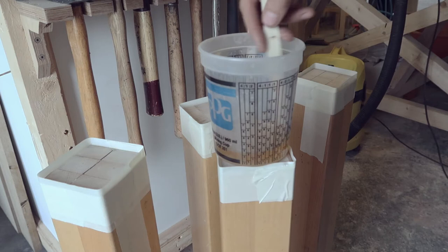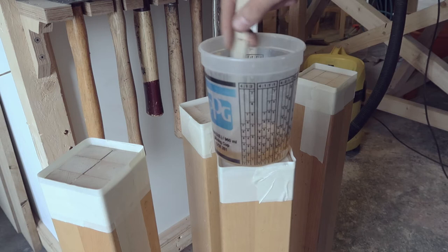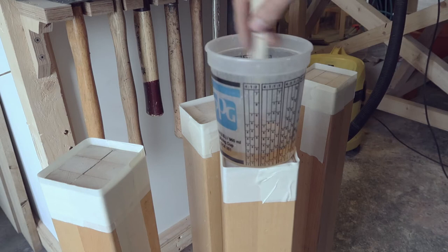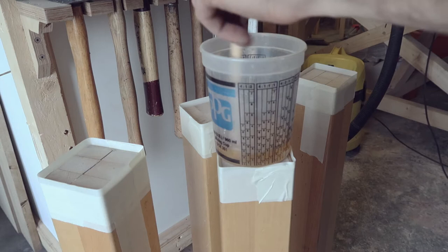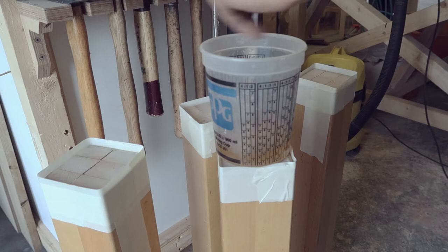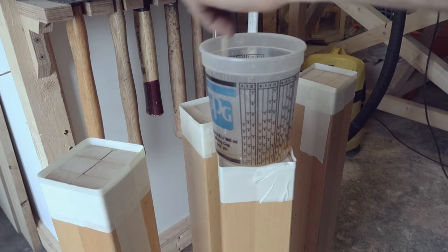Now here we don't really care, but if you're doing, for example, knots or something like that, if you're filling in a piece of wood, when you mix it like this, you put a bunch of bubbles into it. So actually, if you have a vacuum chamber, it would be good to put it in a vacuum chamber for a few minutes to get the bubbles out. And if not, the bubbles come to the surface eventually anyways, but then they kind of stay on the surface and ruin the surface of the epoxy. So what you can do is take a torch and just go over it really lightly, and it'll kind of pop the bubbles and flash off the surface. You can do it with a heat gun also. I usually actually use my heat gun, not a torch.